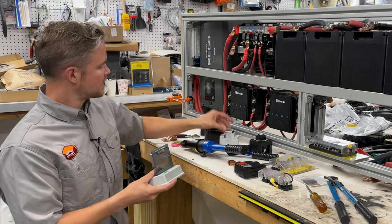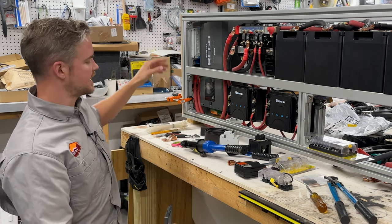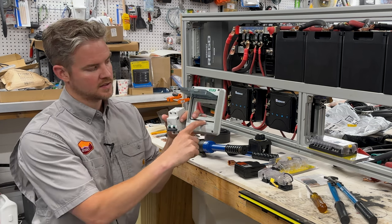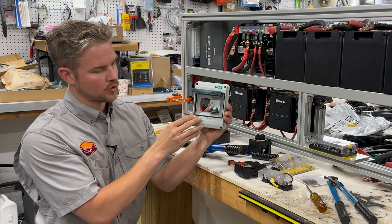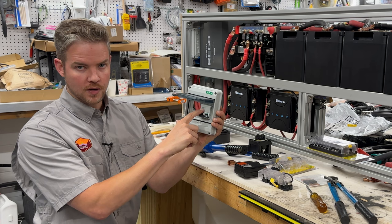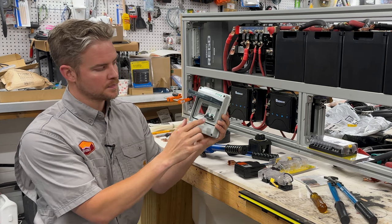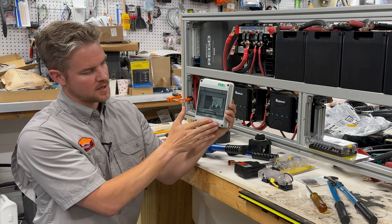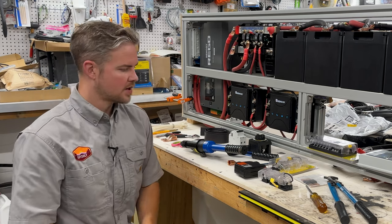So with this layout, we have this box in the very back, and you can imagine if the doors were open and it was storming one day, we have our disconnect switch protected, but we need to protect this. So what this box does is we have our disconnects. There are these little plastic tabs you can break out. So it comes with one opening, but since we have two battery solar panel arrays, we're going to have two of these disconnects. They're rated for how much power you anticipate coming in. So we have one for 32 amps and then the other one I believe is 16 amps, but we have two side by side. This cover comes over, pops in, and this is now nice and protected. So that is part of the back.